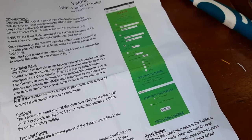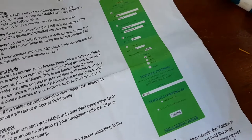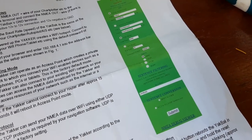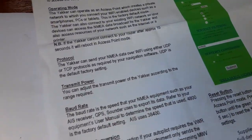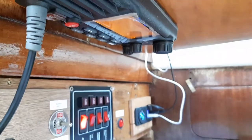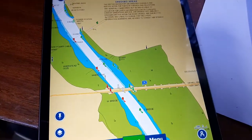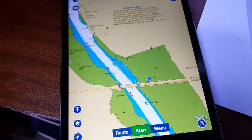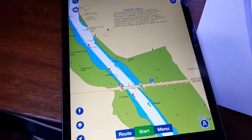Just connect up and make sure the signal speed is set up properly. It should be set to 38,400 baud, but the default is 4,800, so you'll need to change that. You'll also need to set whatever device you've got connected to it to the correct speed, otherwise you won't get anything.